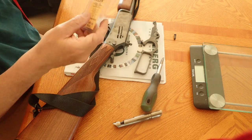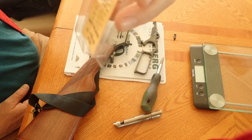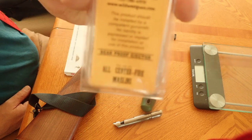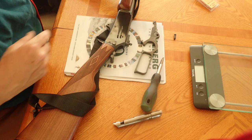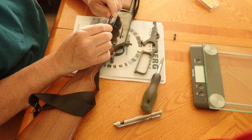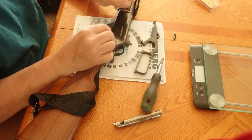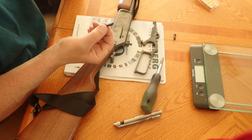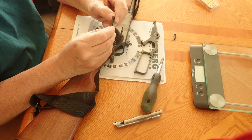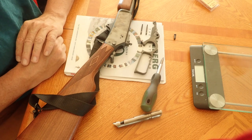You'll notice it says on the little box: Bear Proof Ejector. This product should be installed by a competent gunsmith. Well, if it tends to be a little wide, I would simply put it on a Japanese water stone — a very fine water stone — and just grind it down, making sure you're going straight across it, and then re-blue it. But it turns out I've already installed this and it fits in fine. So this is a drop-in fit.